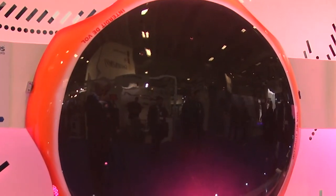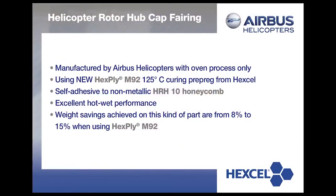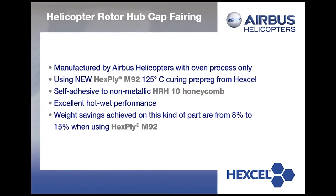Part of the benefit of this resin system is its self-adhesion. With a rather low resin content such as 45–50%, we have very good peel performance. We can produce sandwich parts with no additional adhesive film. This part is the first prototype produced in cooperation with Airbus Helicopters — it is a helicopter dome, which is a sandwich part with a combination of carbon outer and inner skins with HRH-10 sandwich on a honeycomb core.